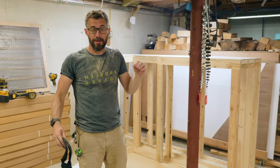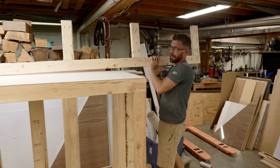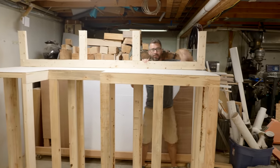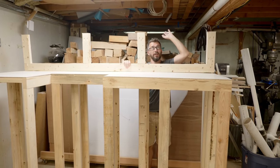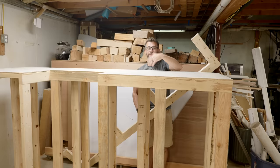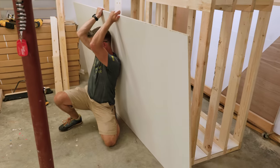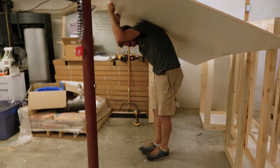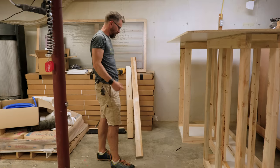A flush trim bit is very handy but it is also very messy — it's all over the lens. This is the top frame, which I know looks silly without a top, but we don't really need another 2x4 up there. It's going to go like this, with pocket holes driving down into the existing structure. Then we're going to have a half-inch sheet of melamine sit on top to act as a very top shelf for deep storage. Before we put this piece in we have to lay that half-inch sheet on top, trace it, take it down and cut it.